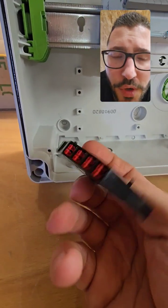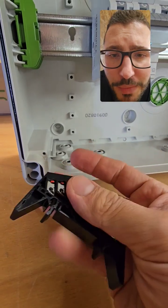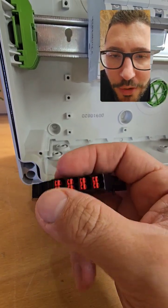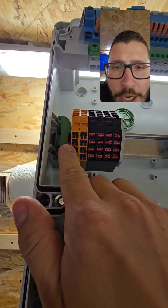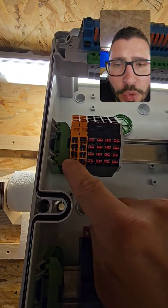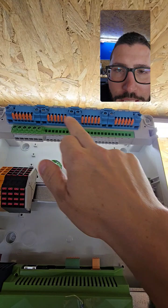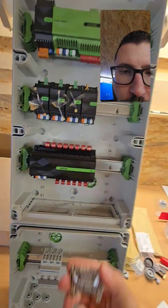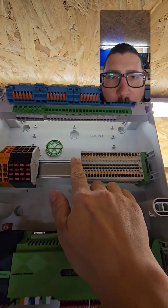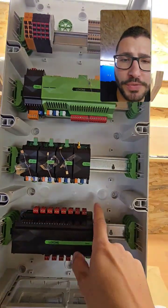For all the interfaces I like to use these clamps here — these are from Weidmüller, a German company, but for you above the ocean you might have Phoenix Contact pyramid clamps as well. These are not bridged so I use Modbus A, B, and ground and connect A, B, and ground on the other side. Whereas these ones here are bridged, so they're perfect for one-wire — for tree, green, and white. Then you have lots of cables to connect to plus and minus 24 volt from the power supply. For the watering system, make sure to check the datasheet because typically those valves are AC, not DC, even if they are 24 volt.